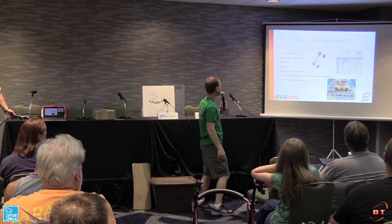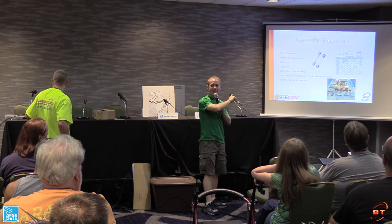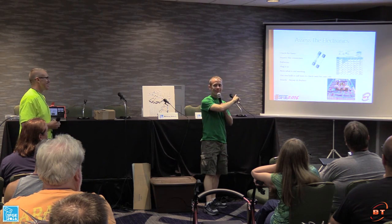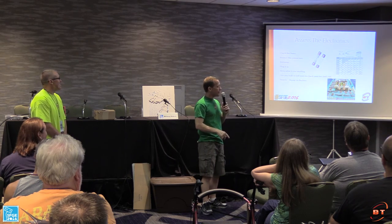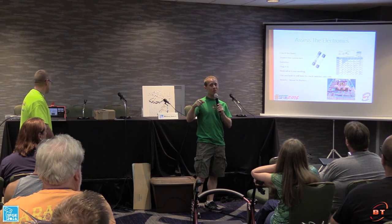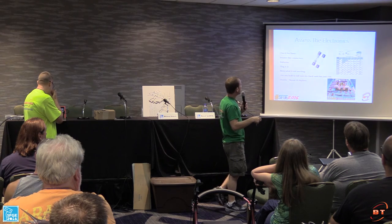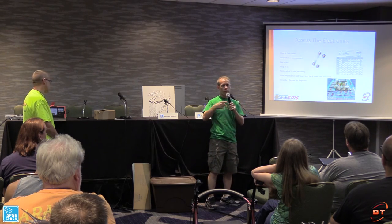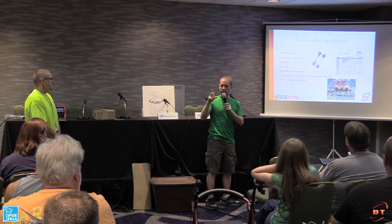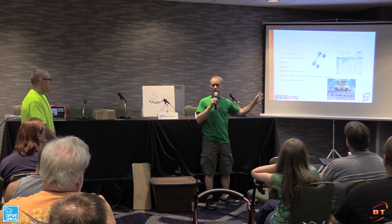All right, so assessing the electronics. Check the fuses. It seems silly, but really, check them. And be prepared. If there's a blown fuse, you stand an even chance that when you power it on, it's going to blow again, okay? So it's not a bad idea to say, okay, well, this fuse is for flippers. Kind of spot check the flippers. See if you have anything dangling, anything that's obviously shorted. You're just going to have to work through the issues, okay?